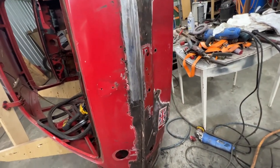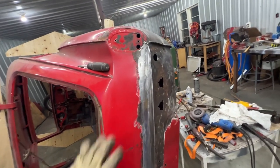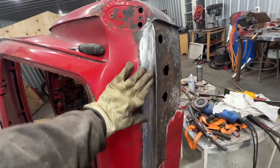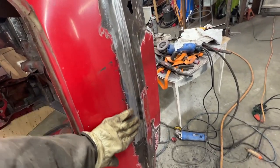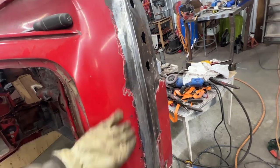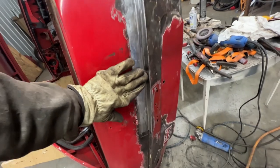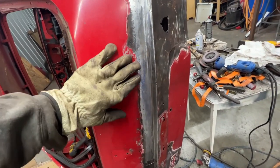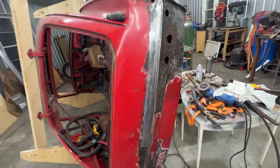So I've been called for dinner, so I'm not gonna finish it today, but I just wanted to show you that actually it is better than what I expected. It didn't warp, it is pretty good. Maybe there's a little low area right here, but here it's so easy now. I can put a dolly inside and with the slapper, I can punish it a little bit. Yeah, here it seems to be high, or maybe that's the paint, I don't know. Have to remove the paint. Anyways,